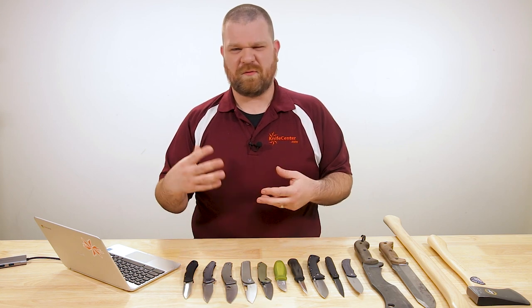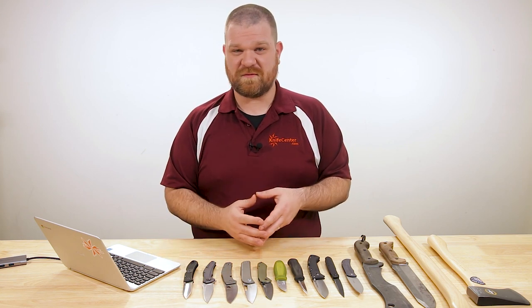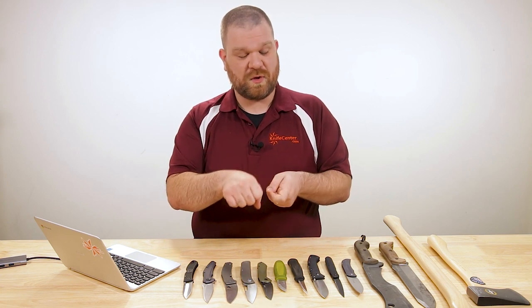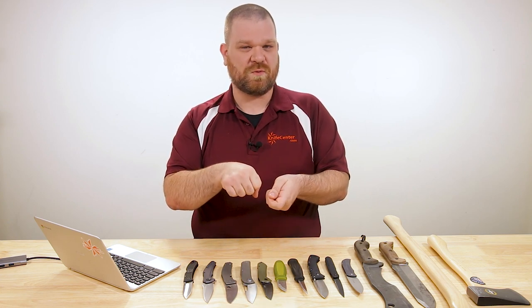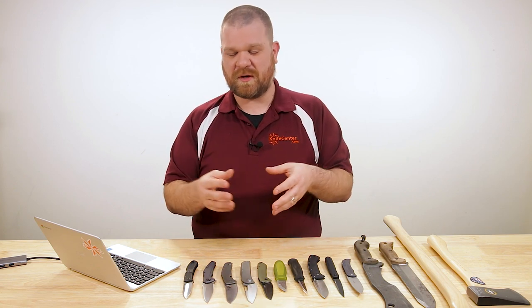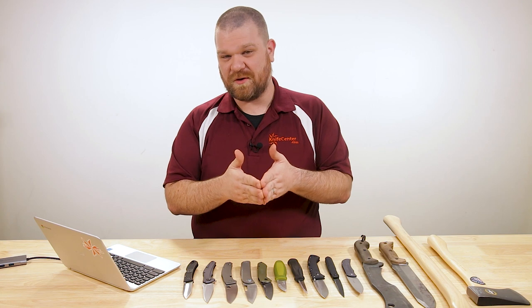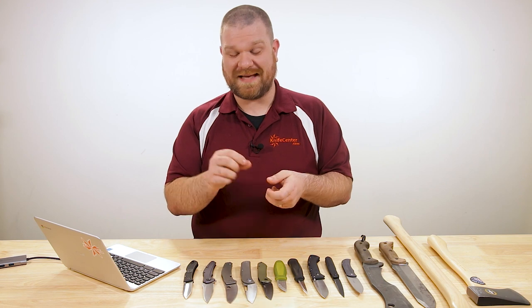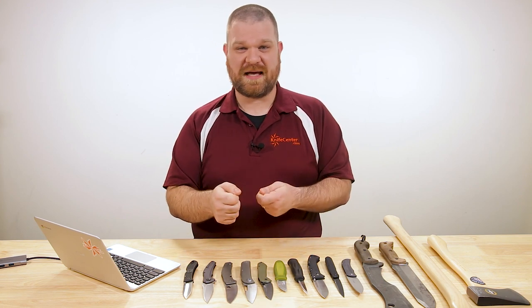If you get something with really big carbides or really high wear resistance, the action of actually wood carving, the actual interface of edge to wood, doesn't always work as well as a simpler steel with smaller carbides and a much finer grain structure that you can actually get laser sharp a heck of a lot easier when you go to do that carving. That's the most important thing when you're doing that job.